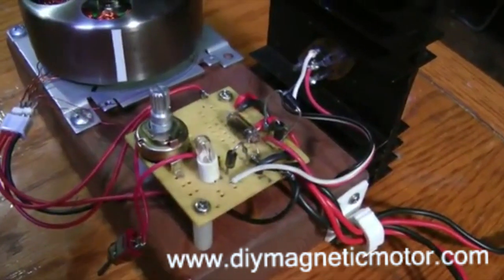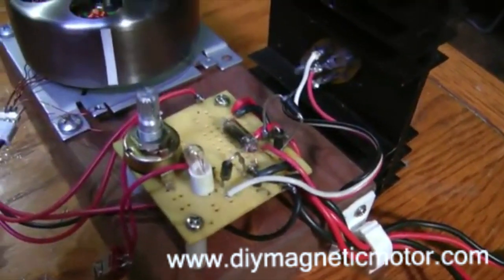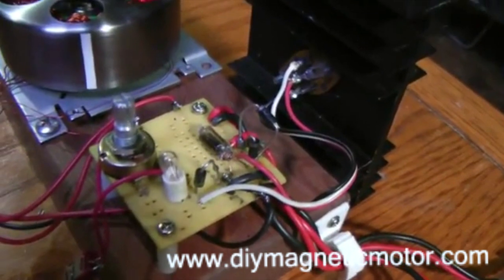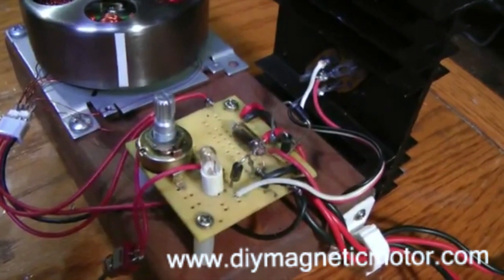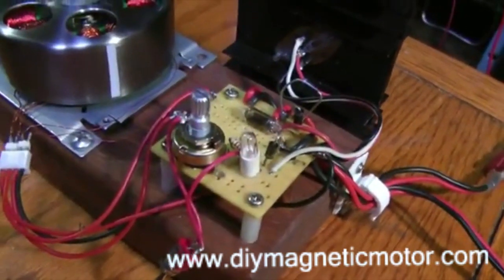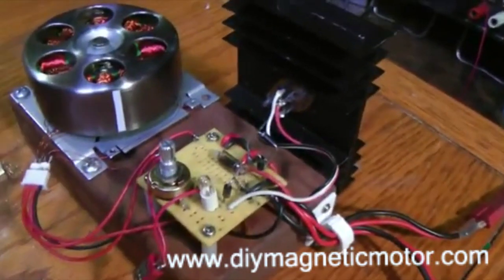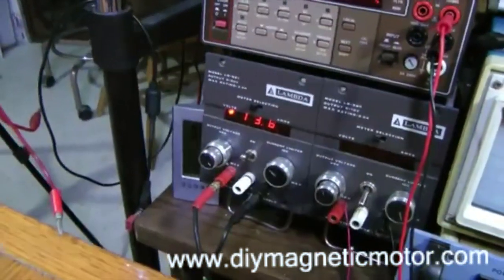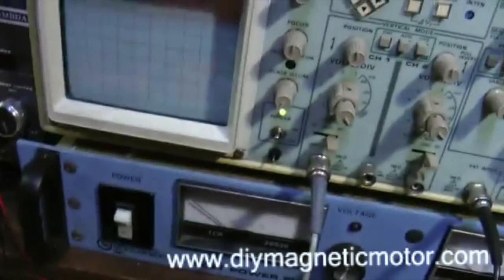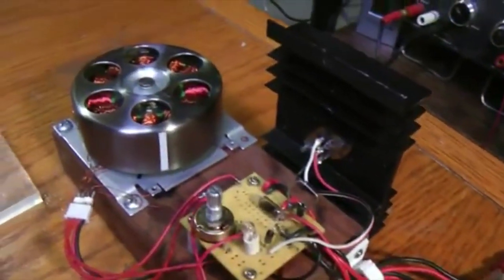Now, people are using this circuit successfully to charge batteries. Let's put aside the radiant energy and everything for a minute, because I have no way to prove whether this particular device is running and successful because of radiant energy or not. I can't measure it. I can't say it does. I can't prove it one way or the other, and I'm not here to try to. But I can show you that it'll charge a battery just the way it is. First of all, I've left the power supply at 13.9 volts where it was to run the other setup because I don't want to change it. And I've hooked the scope up to the output of the SSG circuit, and it'll run as a motor.